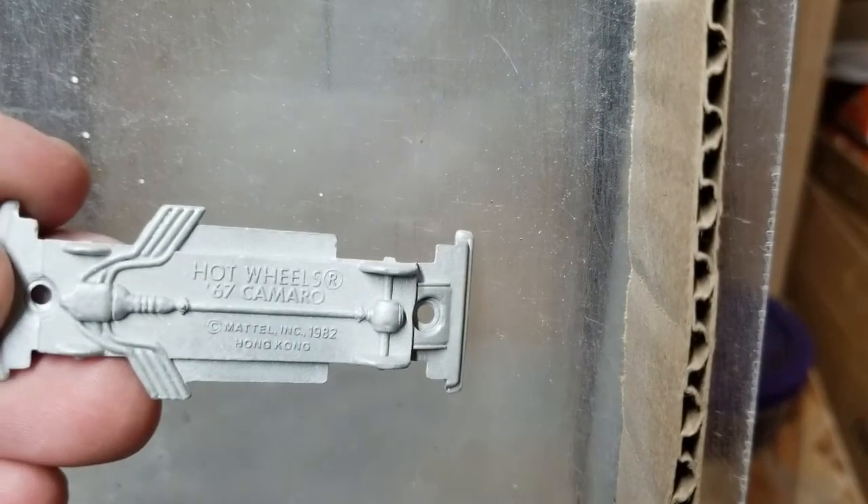We're about done with the chassis in the blast box. Here's a look at our chassis - it does have the sandblast box haze on it, so we're going to get our Dremel tool with our wire wheel and go over this thing fairly quickly. It doesn't take a whole lot to clean it off - it just needs a once-over to get that haze off and it leaves you with a pretty nice, near-polished surface. Polishing will make a little bit of a difference - it won't make a huge difference but you can see there's a little bit of pitting but it is still in good shape.